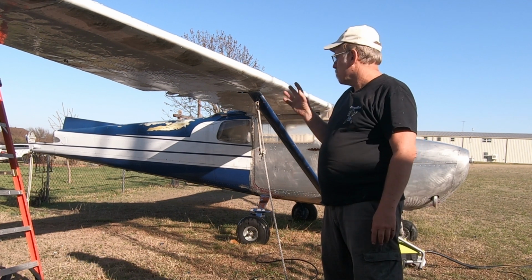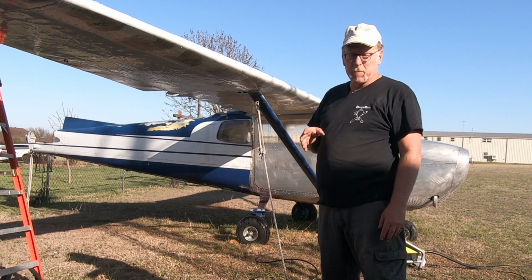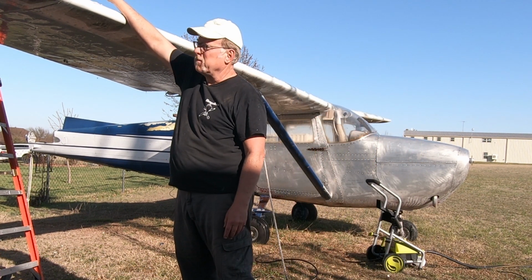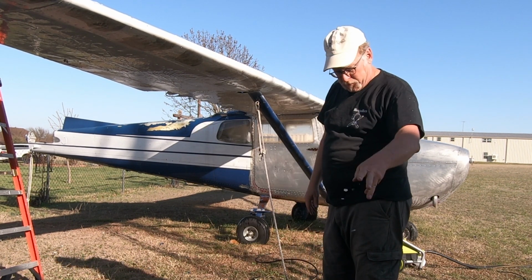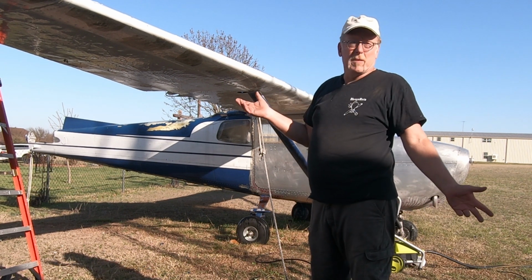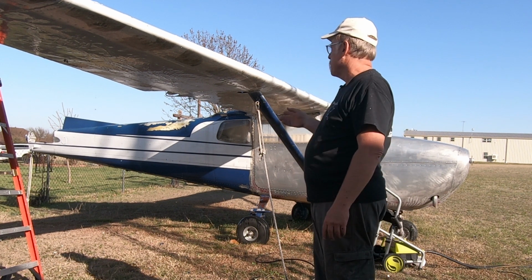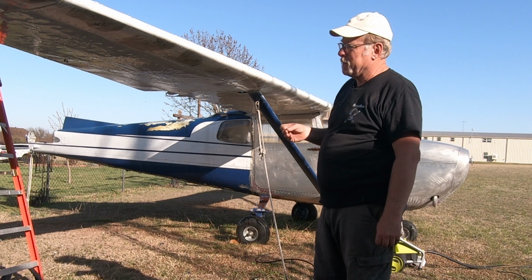Now, I'm just blasting it or pressure washing it, for the most part, on the rivet lines on the wings. As you can see, I don't know if you can see, I'll get a close up of this here. This paint is just falling off. The paint's been falling off. There's paint all over the ground here. But the paint job on this was absolutely terrible. So, no prep, terrible prep. It was a scratch and sand over an old lacquer paint job, a 1962 lacquer paint job.